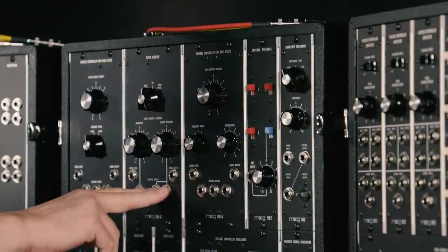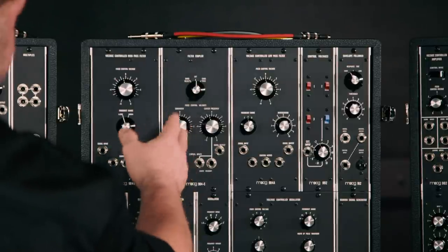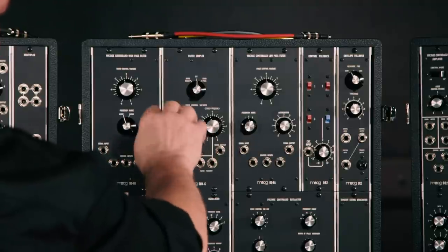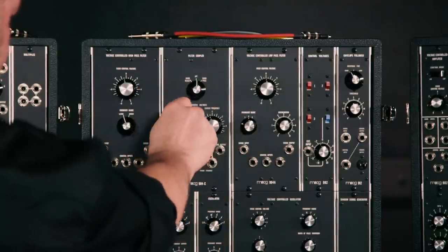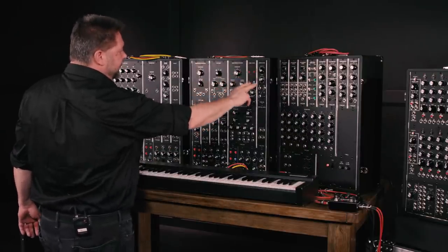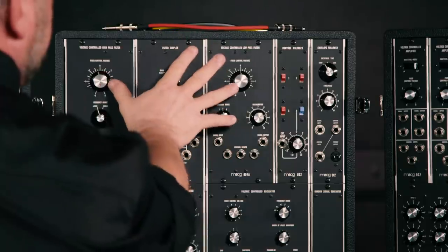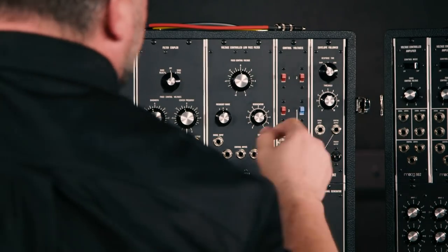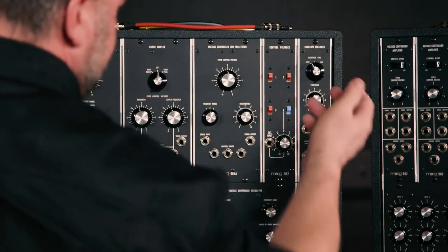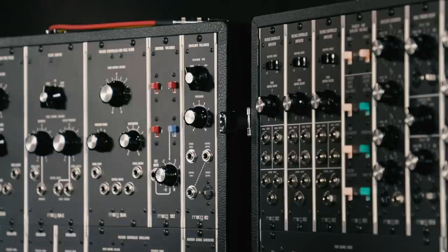They have their own control things for both the bandwidth and center frequency. And that was kind of the inspiration for the separation knob in the Voyager, where you can actually set the two filters' spacing between each other. Then again, another set of control voltage switches that allow me to bring the keyboards or some external source to the sweeping of the high pass and low pass filters. We got an envelope follower, which will take an audio signal and create a trigger output as well as a control output with a short response time, a medium response time, and a long response time.